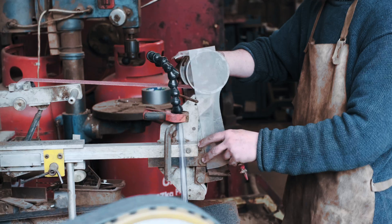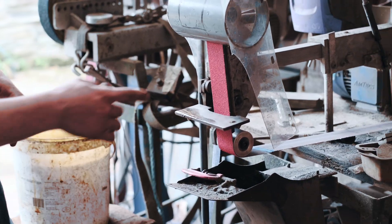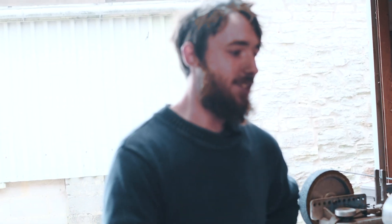After the temper, we'll go to the grinding. As is, it's still full thickness basically — there's a little bit of taper from the forging, but we go straight from the temper over to the grinding machine and grind the bevels in, then finish the bevels pretty much all by hand. Maybe I'm just not a very good grinder, but I can't make the best knife by taking it straight from the grinder. There always needs to be some work right by the edge, just to get it as thin as you can with the right convexity. The edge of the platen is the main issue — somewhere on the knife there's going to be a little bite, two deeper scratches somewhere in the middle of the bevel. I've ground over a thousand knives and still get little dips — just fix it by hand.